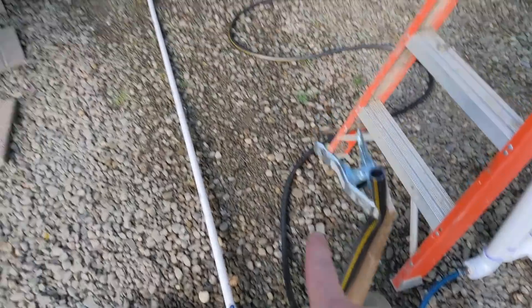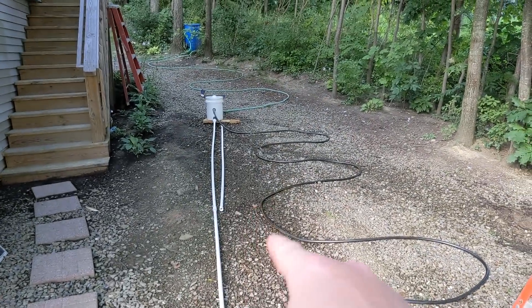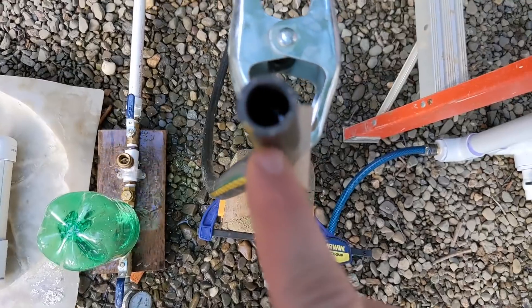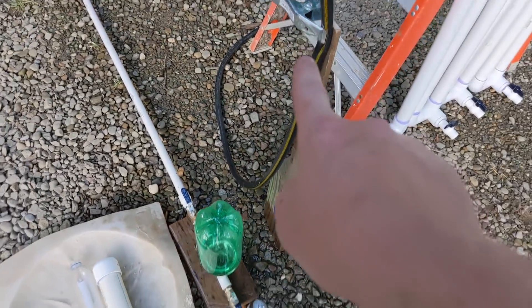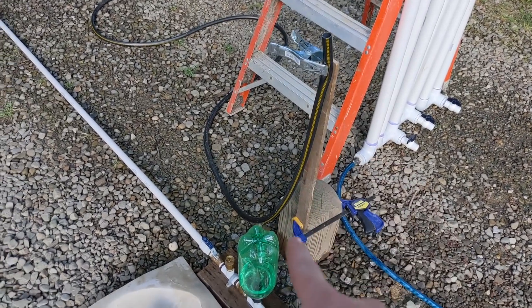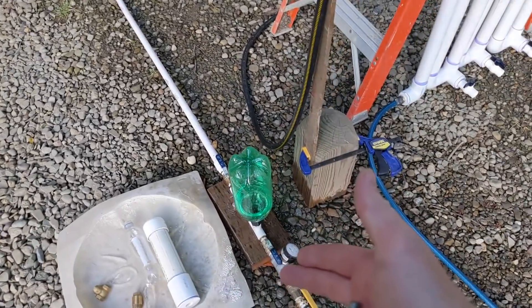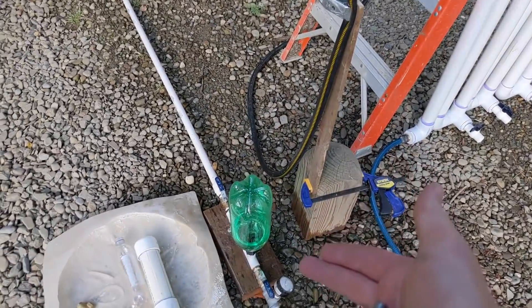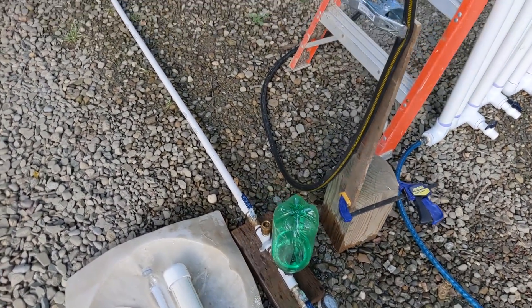We're going over to this black hose here, which is set up as a water level. You can see the water right there. I measured — this is 33 inches of head height, which comes out to a six and three-quarter to one pumping ratio at this low head. Normally with a ram pump you're looking at three feet or more of head height, but this is only at 33 inches, so that's less than three feet.